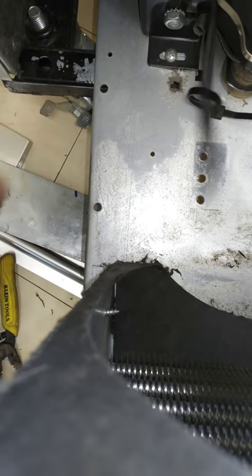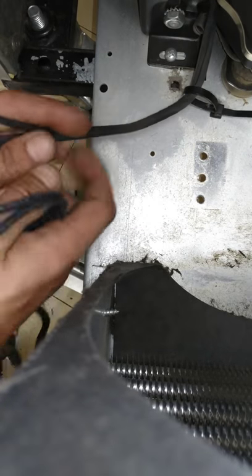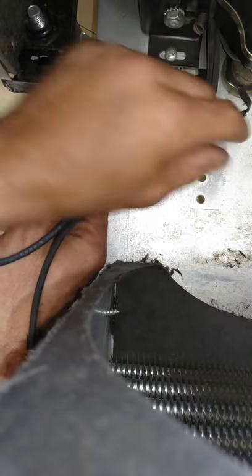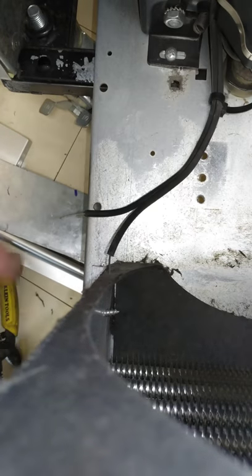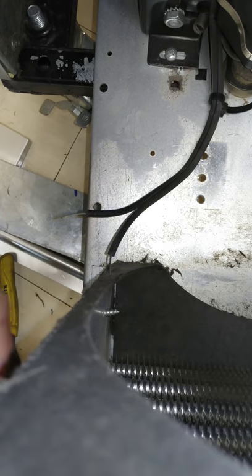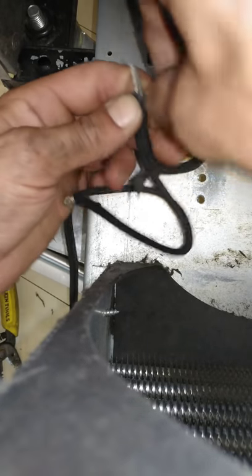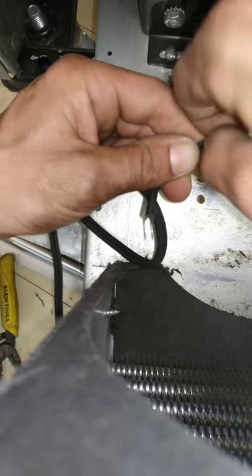Grab your garbage. And then I'll take this one and I'll wire it in first. Zip tight, tight. Wire nut. Make sure you use the right size. Oranges should be good. And if you ever go from copper to aluminum wire, you gotta put some goop on there. They sell it at the parts house. If you guys don't know about it, it's like a heat goop. They use it on disconnects.